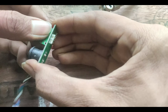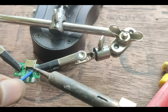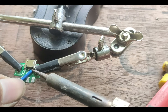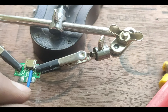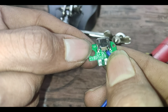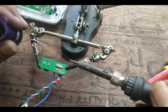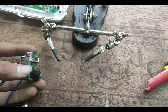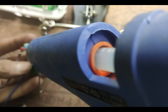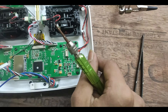The soldering of this piece was a pain but I finally did it. All you need to do now is solder a wire precisely on the rightmost pin of the USB as shown here. Be sure your solder wire is connected properly and does not create a short circuit with other pins. After that wire is done, we need to put the two pieces back together and solder them again. Be sure to add some hot glue so that the wire does not come out. If it does, we'd have to repeat the same process. Then re-screw them back together.